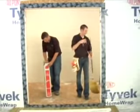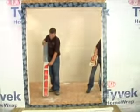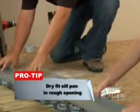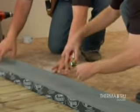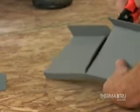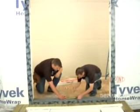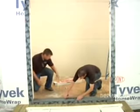Here is the proper procedure for installation of a ThermaTru sill pan, which we recommend. First, dry-fit the sill pan in the rough opening following the instructions furnished with the sill pan. Check the center section for proper length, and if necessary, cut with a hacksaw or tin snips. Be sure to allow at least 2 inches of overlap at the joints. For openings less than 52½ inches, only one center section is required — cut as necessary.